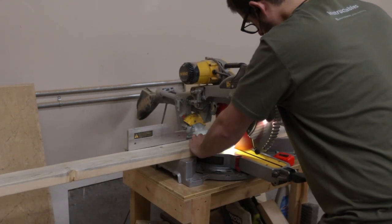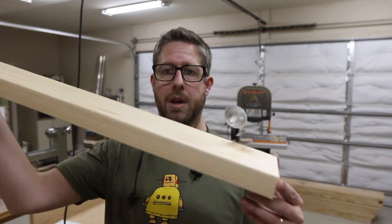So I'm not very far into this project and I've already messed up. Let me point it out so that maybe if you build something similar, you won't make the same mistake. I was measuring 46 and an eighth to be my overall height. So then I started subtracting the casters and the plywood top. I came upon that number and just started cutting my 2x4s. I started looking at them and they looked strangely too tall. What I forgot to subtract was that height was to the center of the spindle. We have to build the cart from the spindle down to the cart top where it sits, and that was another 13 and a half inches. So I was off by just a foot.